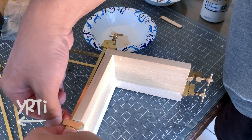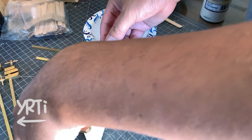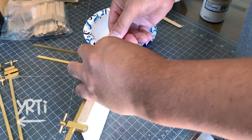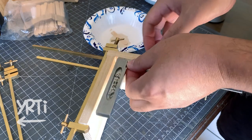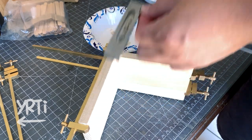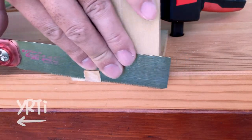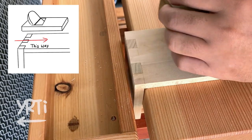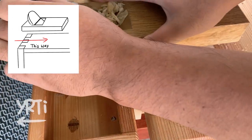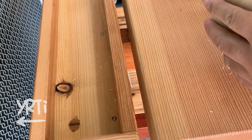Finally, it's time to glue up. I suck at the glue up and I forgot to hit the recording button again, so this is the second joint just for this video. I don't have any tips, but just be sure to make it 90 degrees. Then I cut the excess with a flush trim saw and do the hand planing. You should always do it to the inside so the end grain won't break. If the end grain is too hard, you can put a little bit of water on it to soften. And then after putting oil, here's my box joint.